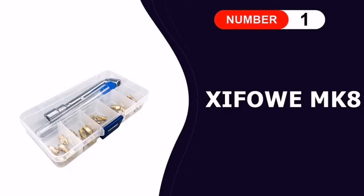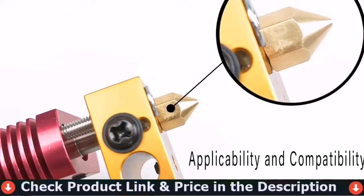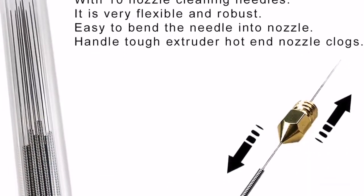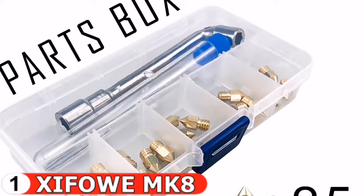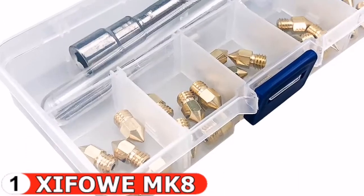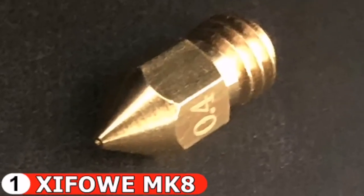Number 1 in our list is XIFOWE MK8 Nozzles. XIFOWE MK8 is one of the most well-known nozzles in the 3D printing industry, owing to their creation of the popular V6 hot end found in many 3D printer extruders. As a result, their nozzles are designed to work with a wide range of 3D printers and are high-quality products. Input diameter is 2.00 mm, output diameter is 0.4 mm, outer thread is M6, and thread length is 5 mm. The outer surface is marked with a size.